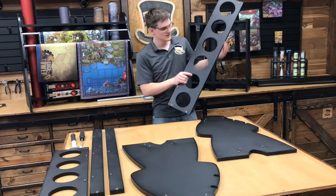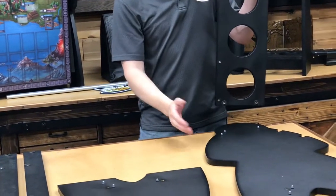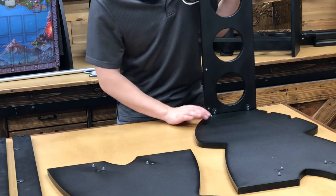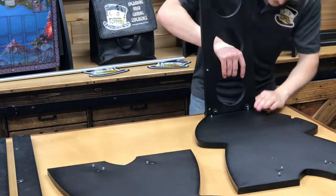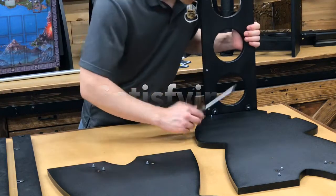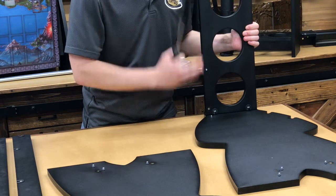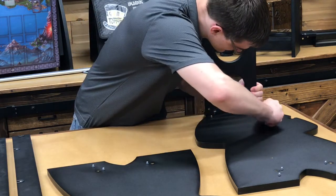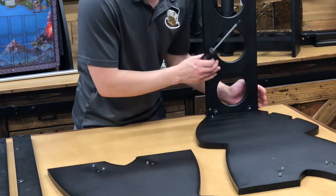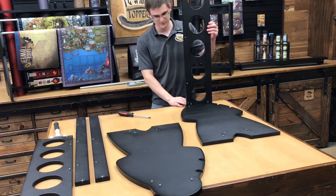Now readjusted so you can see — take this piece making sure the cam screws are facing the floor and that these three are lined up with the back end of the mat rack. Set these and line up the cam holes with the cam screws and they slide forward and just lock in. Both snap into place — it's actually really satisfying. Then take your screwdriver and tighten the cam screws clockwise until they're tight. They don't even turn a full turn — about a half to three quarters of a turn and it's tightened up. That's attached.